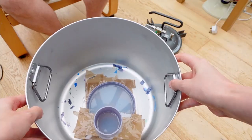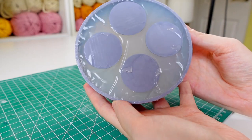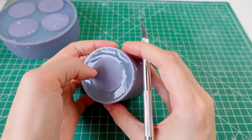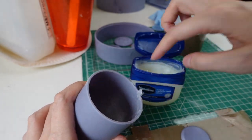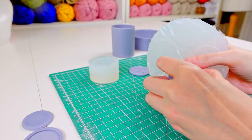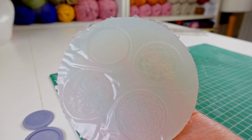Time skip to the next day. Wish me luck because it's Sunday and this video is due out on Wednesday, and if this didn't work, I honestly do not have a backup plan. Ripping all of yesterday's work off here is pretty satisfying actually. Ample evidence that I did not in fact manage to get the packing tape anywhere near flat. Now I'm just very carefully and lightly scoring around the edges wherever silicone has crept underneath the master, because we want these moulds to have a nice clean line around the edge to reduce clean-up on the final pieces. I'd also liberally applied vaseline around the edges of the mould moulds, so these pushed out pretty easily. Unfortunately, the same didn't apply to the blanks themselves — it took ages to get them out because they'd formed a vacuum, and also because I was really wary about yanking too hard and ripping off any delicate bits of silicone inside.